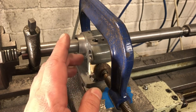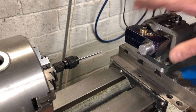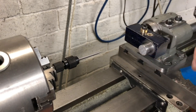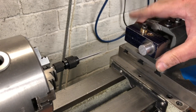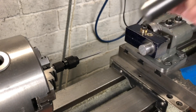The last thing I need to do in this setup is to machine the final hole in the tailstock block here, so let's get that set up now. The casting has not moved position, so we are right on the axis of the main bore. This whole assembly is designed to hold a 60 degree centre to provide tail support for work that might need it — that's why it's being done now, as this assures the concentricity we need. The block is clamped tightly onto the bar, but the bar is free to rotate in the main casting. All I need to do is rotate this and pick up my centre punch using the wiggler — this is only an aesthetic alignment to centre the hole in my layout; it will be in the correct position by virtue of the setup. The clamping cotter is held in place to be machined at the same time, and I will drill this out most of the way and then bore the hole to be a close fit on a piece of half-inch silver steel — in fact, this piece of half-inch silver steel that I'm going to use to actually make the centre.